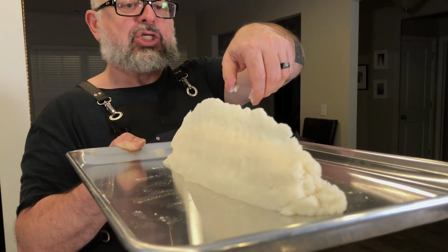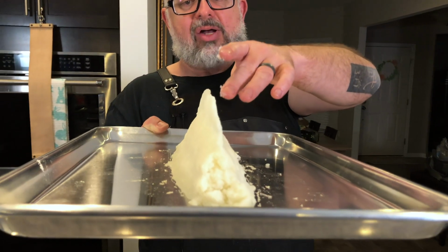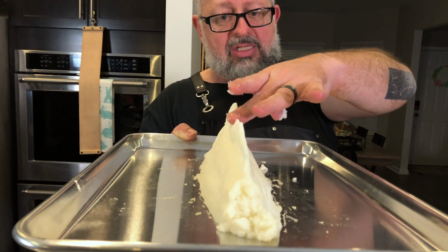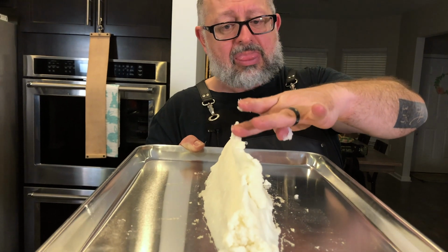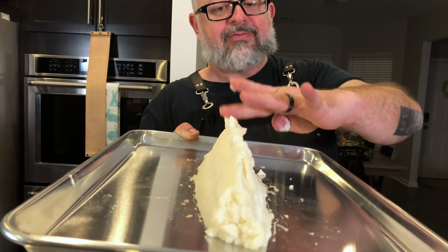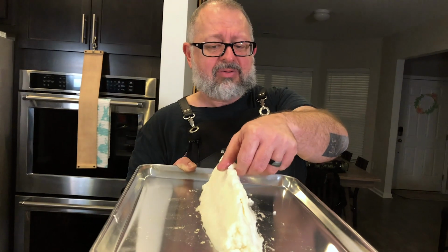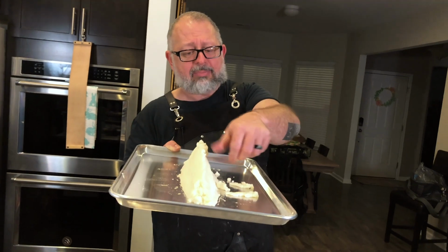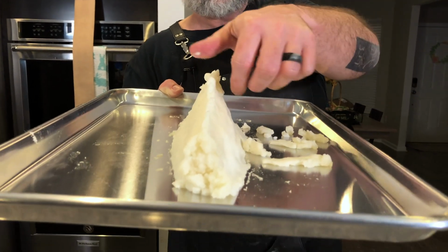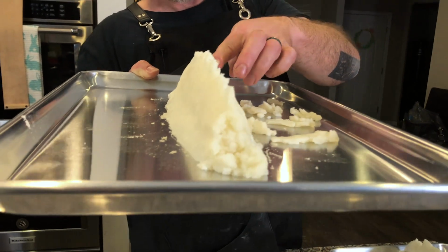And the problem is you believe for a moment that this beautiful pointed edge is somehow a sharp edge. But the moment you press this flimsy edge into food, it's going to mushroom. And when it mushrooms, it's going to turn over. And as that turns over, you're going to find that the next thing you cut gets very dull very fast. Okay? And you can still see that the apex was really below it the whole time. Look at how much more firm it is once you rip the thin wire off. Now that's the part of the knife that really will have great edge retention.